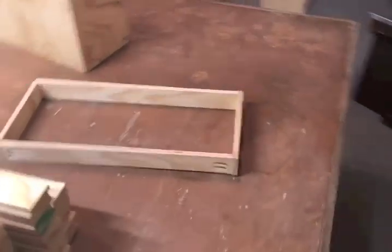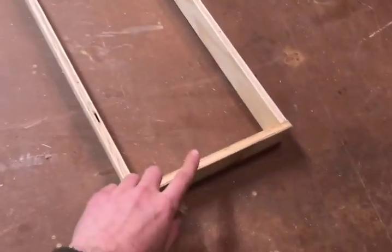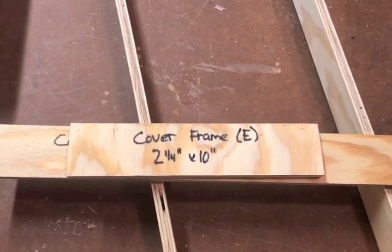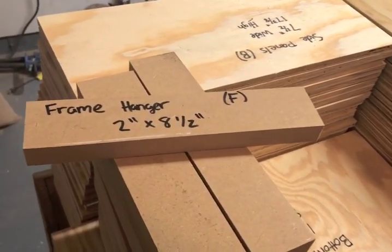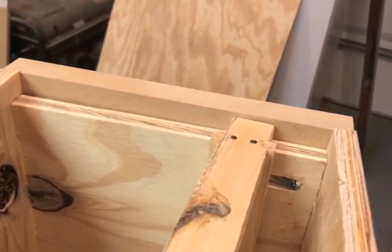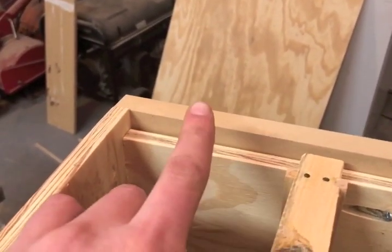The cover, which still needs a top for it, has a long side and a short side. For the cover, the long side was 2-and-a-quarter by 21-and-a-quarter, and for the short side, these were 2-and-a-quarter by 10 inches. Next is the frame hanger — these were 2-and-a-half inches. This is the piece that sits on the outside and allows that frame just to sit right up underneath the lid. There's 5-eighths difference between the bottom here and the top right here — plenty of room.